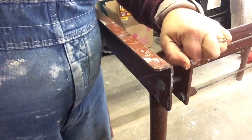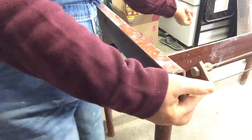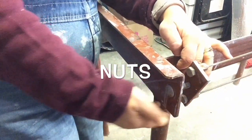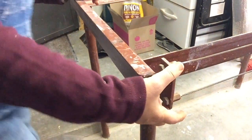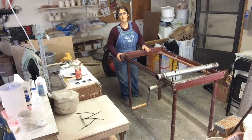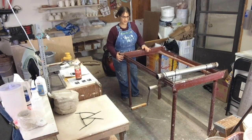this is called the tension plate, and the tension plate is wiggling like this as the rollers roll down and create the slab, because the bolts are on the wrong side. If we have one bolt here and one bolt here, sandwiching the plate, it won't wiggle like that, and we won't have the fraying issue that we have in the cables. So the way it's supposed to be is nut, plate, nut. And so we have to fix that.